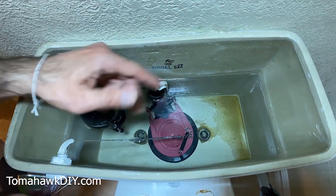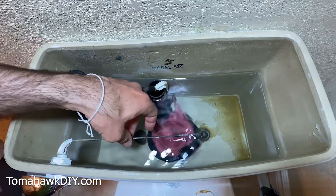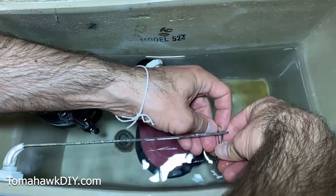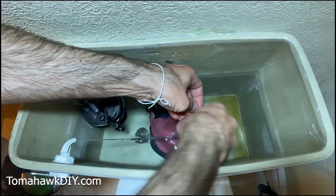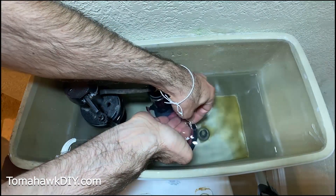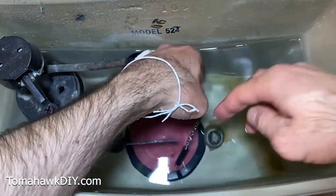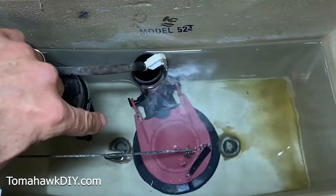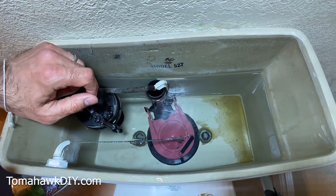Now that you've stopped this, you might be tempted to give up there. But since the chain got stuck once, chances are it's going to get stuck again. See how it's hanging down so low. The easy thing that may work for a time is just adjusting the chain length. Figure out how to disconnect this and find a way to change the length of the chain. I'm just going to hook it farther down — that'll shorten the chain — and re-hook this. That's now shortening the chain, which will probably keep this from causing problems for a time. But if you stop there, you're going to miss a problem and you're going to have to fix it again.